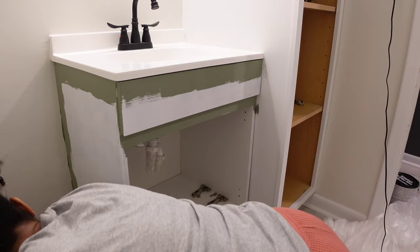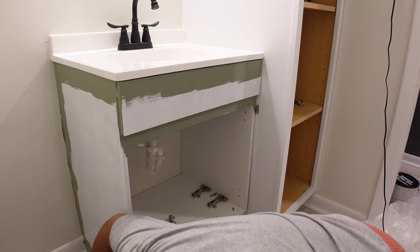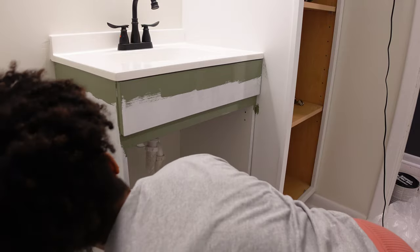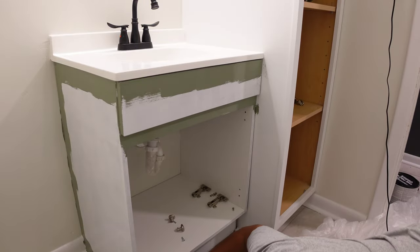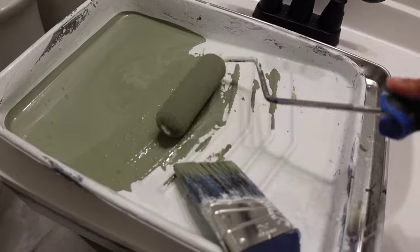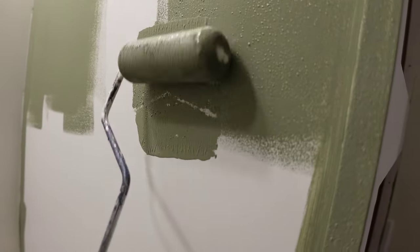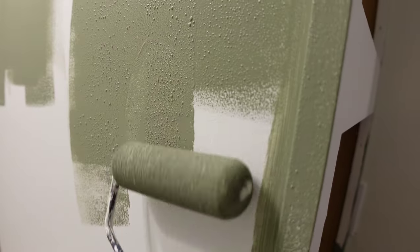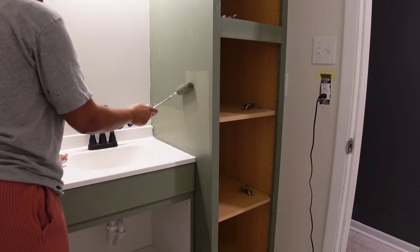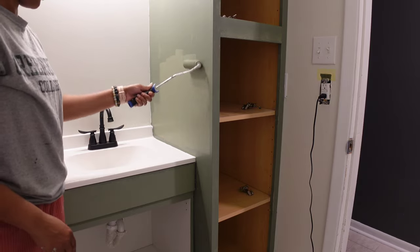Right now I'm going in with an angled brush. I do not tape anything up — I hate the prep for painting. I love painting, I just hate the prep. When it comes to prepping your cabinets, you're supposed to use blue or green painter's tape and tape everything off so you don't get it on the walls or the floor. I would rather freehand. Looking back on this project, once I was painting with that foam roller, I really wish I would have done the entire project with a paintbrush — I would have rather had paint strokes than bubbles. The bubbles were really bothering me. Between each coat, I waited at least two hours before reapplying the next coat, so this is an all-day project.